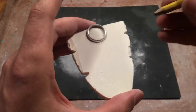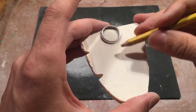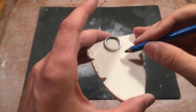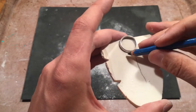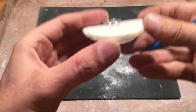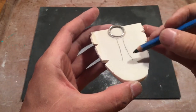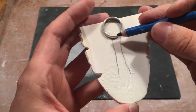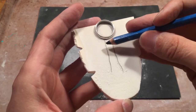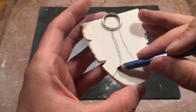You want to make sure you have enough material so that all your metal can flow to your band ring, and create a channel deep enough to get that metal to flow. Depending on how thick your cuttlefish is, you can dig a deep narrow trough or a wide trough — it doesn't matter. What you don't want is to have your metal choke and not give you a complete casting. I'm going to make this just a little bit wider to improve the flow.